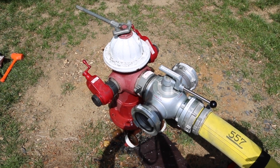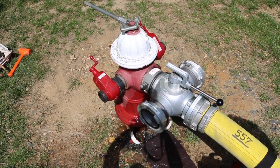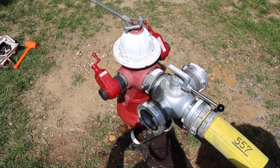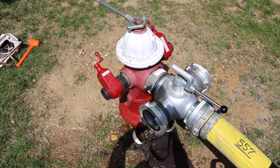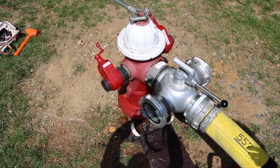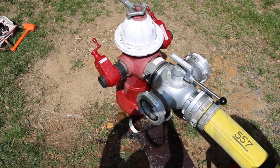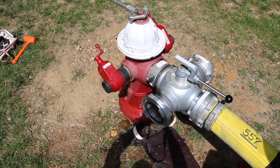Looking at our fire hydrant, we have our two two-and-a-half-inch gate valves connected on the outlets on the side of the hydrant, with the hydrant assist valve on the front steamer connection. We can see that the five-inch supply line — when 204 performed the forward lay — is connected on the front connection on the hydrant assist valve, labeled 'to fire.' We also put a label on there that says 'supply to the scene.' There are two other connections on the hydrant assist valve that are both labeled as well.